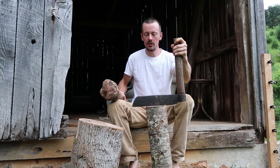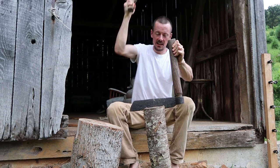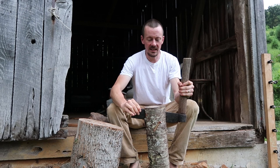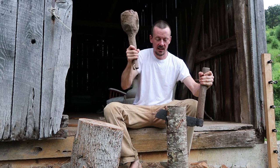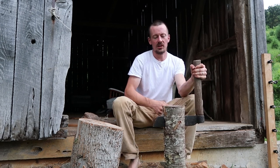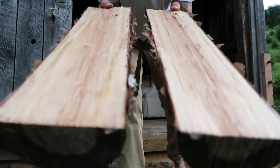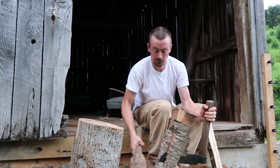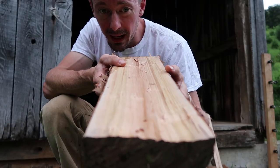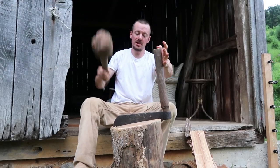I'm going to split this little cherry log right down the middle and start it with some serious pounding — this is referred to as bonking in some circles. When you're splitting shingles, there's a lot of pulling and twisting to direct the direction of your split. There's our little log split in half. I now have a slab that I could finish off with a draw knife. This is a dry tulip poplar log — it would be much easier to split green.